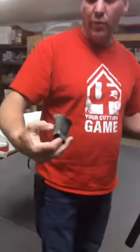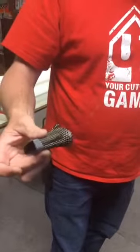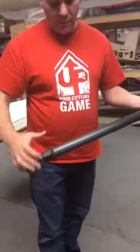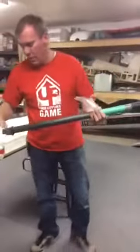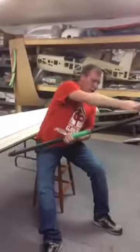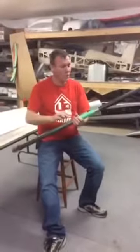Then I used a 1.5 inch woven carbon fiber sleeve. Now you got to be careful with this stuff, always making sure to wear gloves when you're applying it and things like that, because it is toxic. Then we just sleeved it up on to the tube. I wetted the tube down with some epoxy, then I slid over the dry wrap. Then I just took a pair of gloves and I pulled on it, stroked on it.